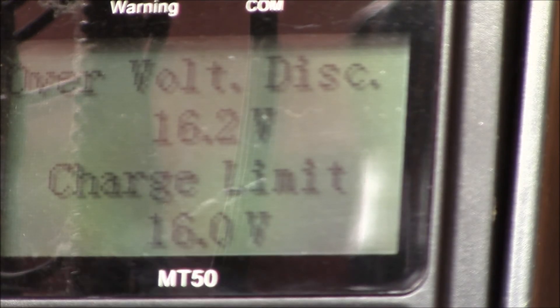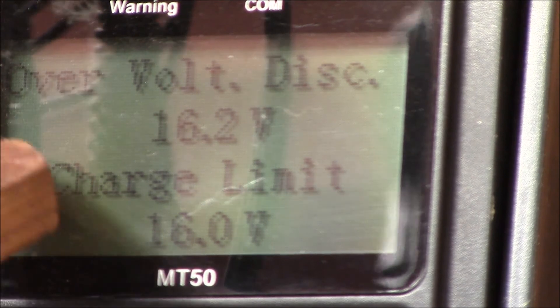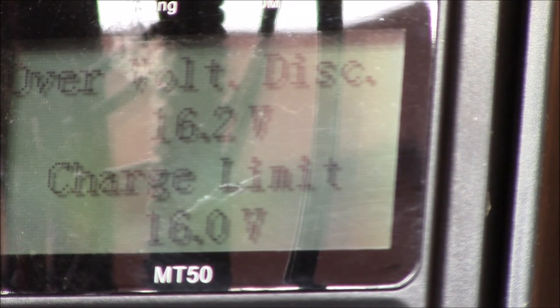The other issue with the EP Solar is there's no battery voltage sensing, so these values have to be set a little higher than the actual battery voltage. It's a fine line — you have to keep things high enough so the EP Solar doesn't limit charging, but low enough that you don't overvolt other things in the system. You can only test these things under load: get the system cranking at full power, put a load on the inverter, have loads switch on and off, have clouds shade the panels and trigger the cloud edge effect. It's those extreme conditions that cause all the problems. This was the first shutdown I'd had in about six weeks.